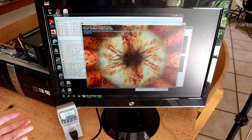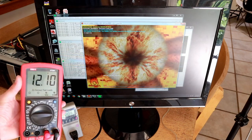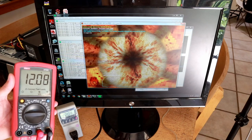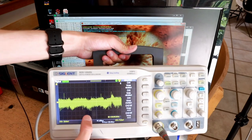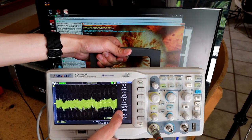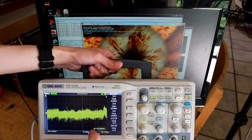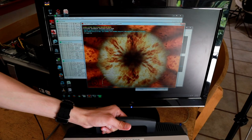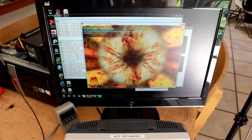Next I'm getting the oscilloscope and voltmeter in. Measuring from one of the Molex connectors on the ATX power supply, we're getting about 12.1 volts, totally within tolerable parameters. On the oscilloscope — zoomed in to 20 millivolts per division — we're getting approximately 12 millivolts of RMS ripple on the line, with a peak max of 56 millivolts and a peak min of 43 millivolts. So basically around plus or minus 60 millivolts under full load with the good 500 watt power supply.